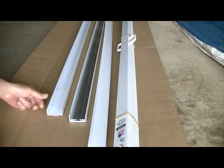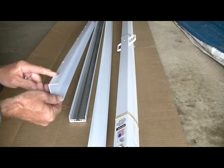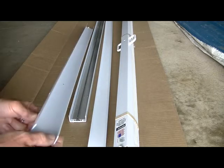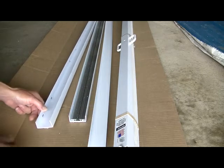The parts you get for the shower install: you've got the bottom track, with a series of drain slots and holes in there. Face that towards the tub so it drains into the tub, not into your bathroom floor.